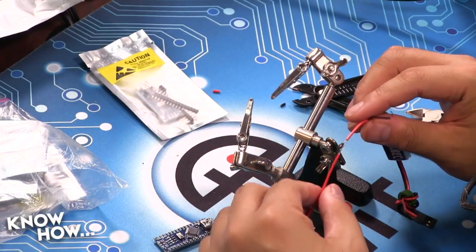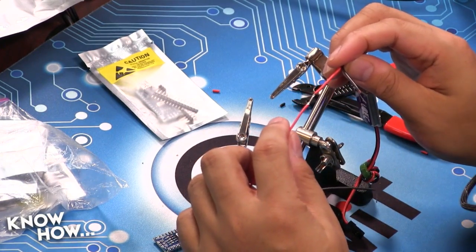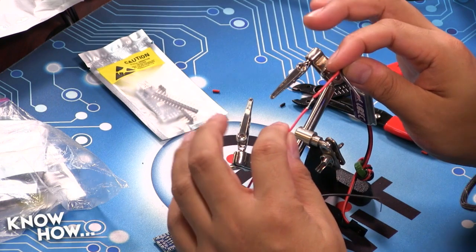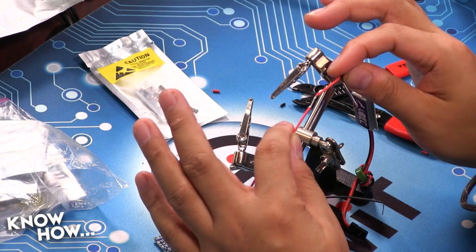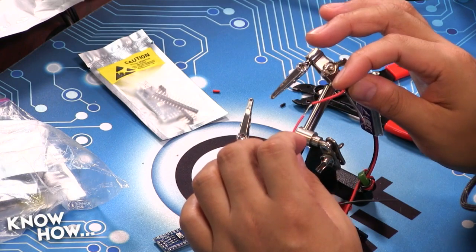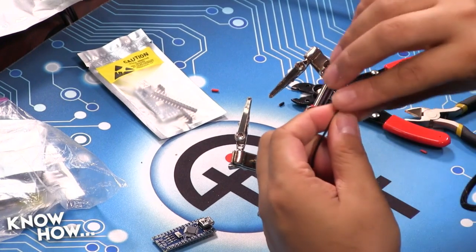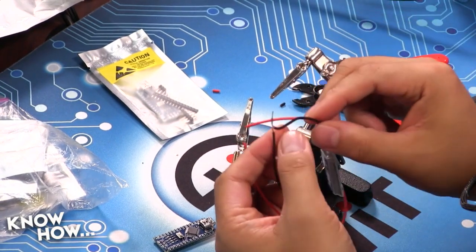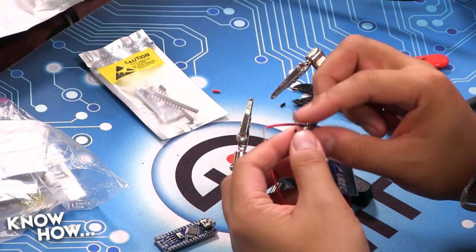And it happens. Now, let me point this out. This is typically the way that I join. What I'll do is these are twisted together, but it's in line. And the reason why I want to do that is because when I flow the solder onto that, that's going to give me the strongest possible joint between these two wires. In fact, the wires on either side will break before the solder joint does. Some people will do this. Actually, I used to do that where you just twist them together. But that's messy, and it actually leaves a really weak point right there. So I don't do that.